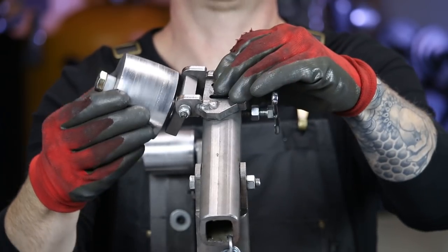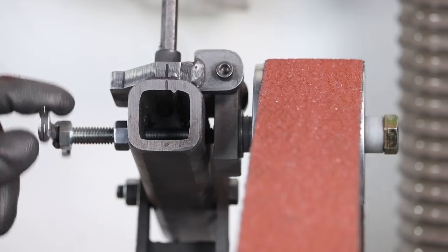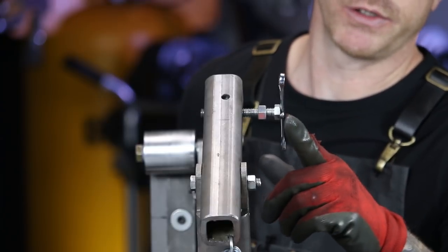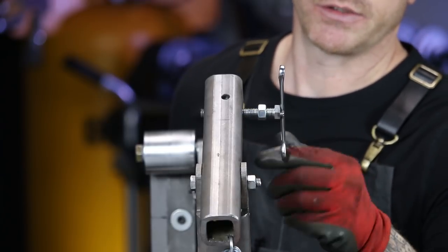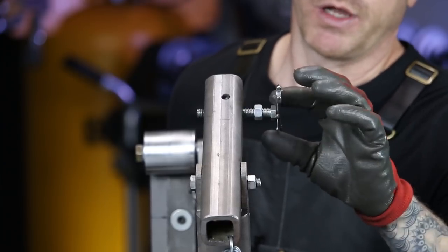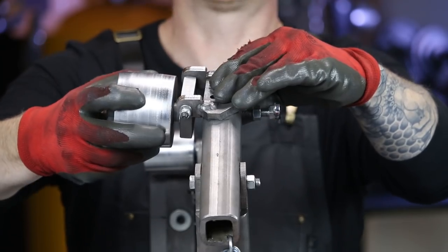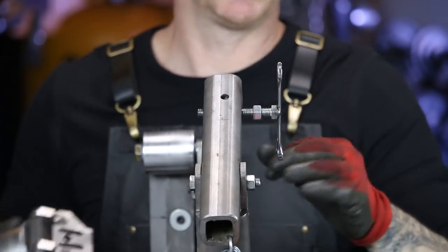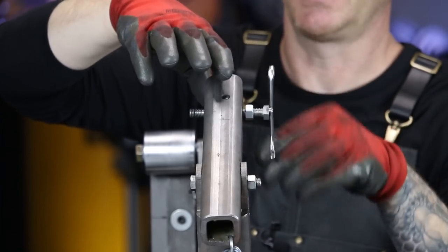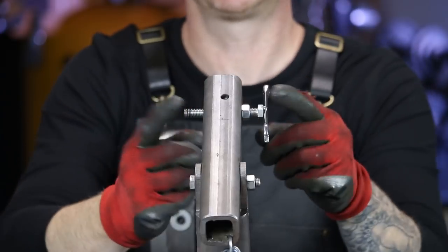If you thread this out, this tracking mechanism will go up and down using this dial right here. I got creative because I didn't have a knob and I welded an old wrench onto the nut so that it makes this easier to turn. They actually sell knobs for this kind of thing with a three-eighths inch bolt — that's as simple as that. I put an extra nut on there just in case I'm doing something that's creating a lot of vibration — you can actually tighten it down and that nut will create a little bit more tension to keep this in place.